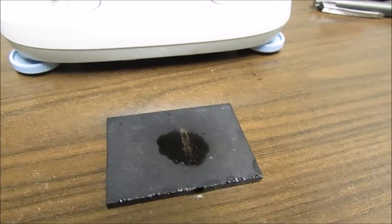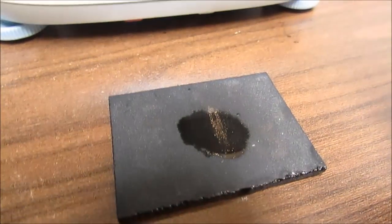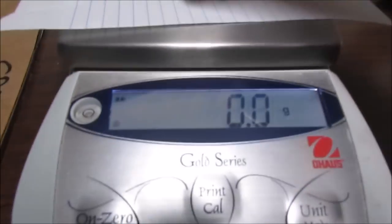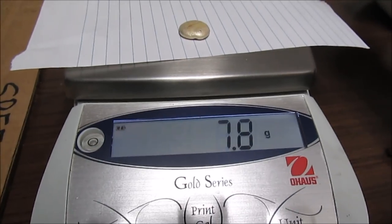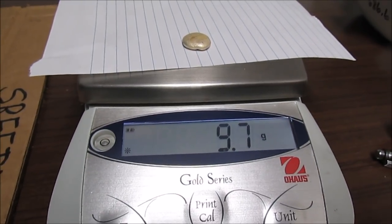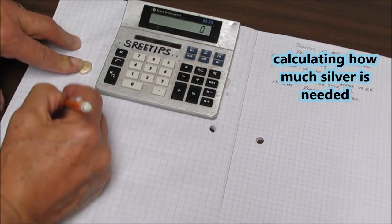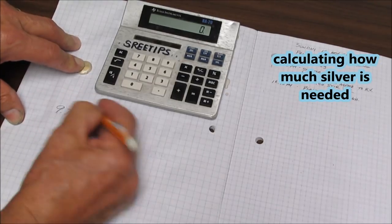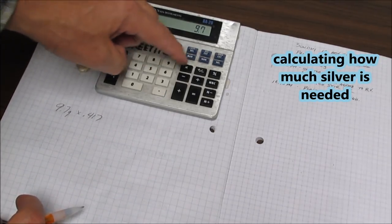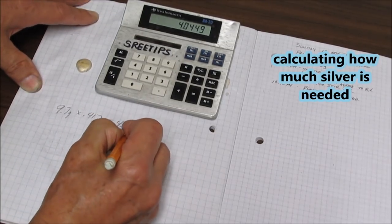While I'm waiting for that solution to cool so I can filter it, I'll get started working on this button. I've got some 14k test acid on it, but this stuff is probably less than 14k. I'm going to go ahead and weigh it — I've got 9.7 grams. It's saying 14k but I'm going to call it 10k. So that's 9.7 grams at 0.417, which equals about 4.04 grams of pure gold in this button.